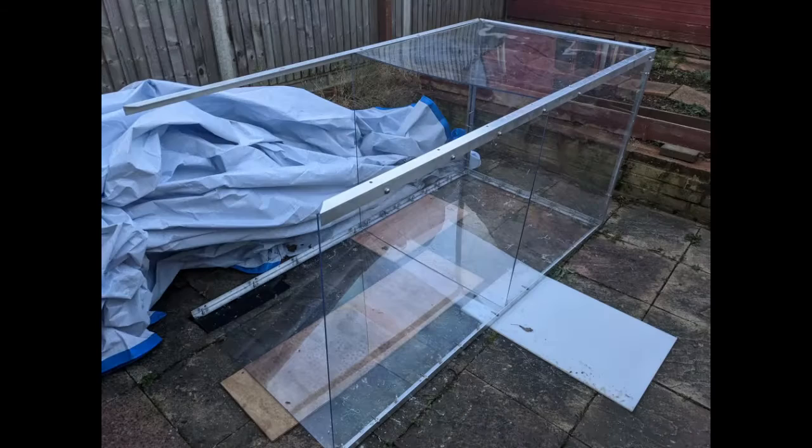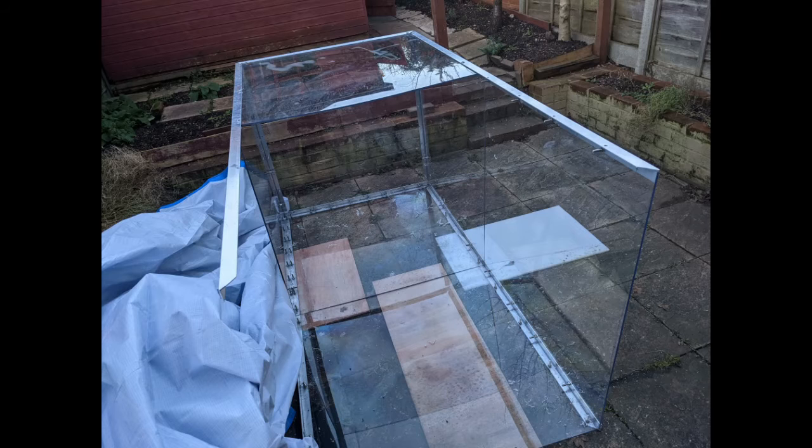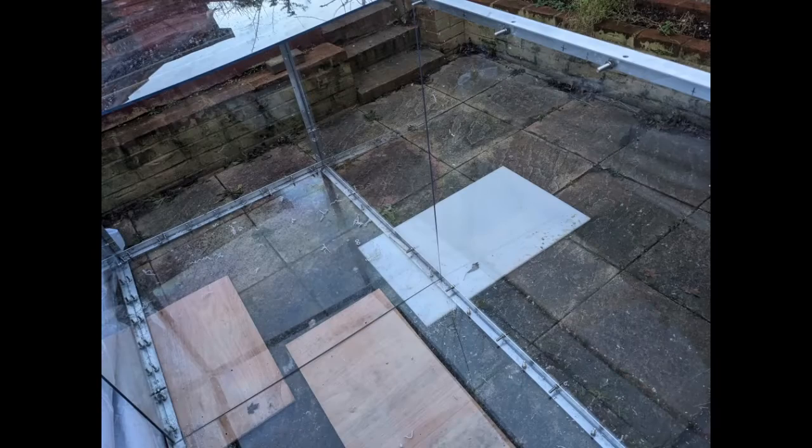It was nice to see that the metal angles were actually two metres long and the polycarbonate panel pretty much went all the way to the end of the metal angle. Once this was in securely, I could install the seventh polycarbonate panel, which meant there were only three to go. I had to prop up the middle of the box to allow the panel to fit properly, because the tiles on the garden floor were not quite level, so the box was slanted towards the middle a bit. After that, the panel went in with no issues, and with more screws available I was able to go back round the old panels and reinforce those with more screws.